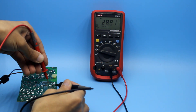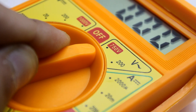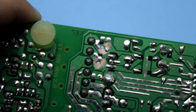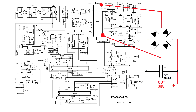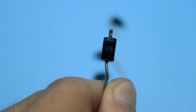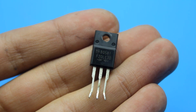For measurement, I use a multimeter of the True RMS class, which is able to correctly measure high-frequency voltage regardless of the shape of the voltage. A conventional multimeter is not suitable, as it is intended for a sinusoidal signal at frequencies up to 1 kHz, but in this case the voltage is rectangular and the frequency is greater several times. Then, at those points we drill a couple of holes and solder wires, which are connected to the input of the full-wave diode bridge. The factory rectifier on the computer power supply board is left unchanged. As the rectifier, four HER505 diodes are used — these are 5A high-speed diodes. Ordinary ones don't fit here; we need ultra-fast, fast, or at least impulse diodes adapted for operation at frequencies of 100 kHz or more. Schottky diodes are ideally suited.